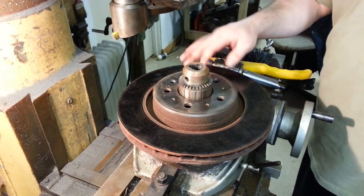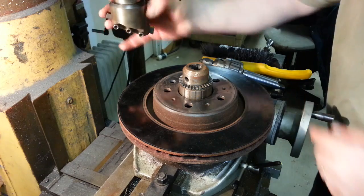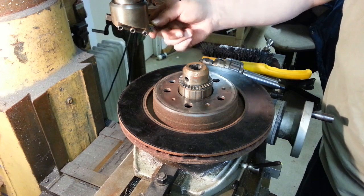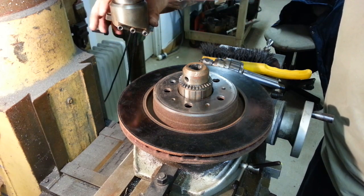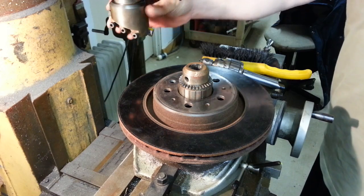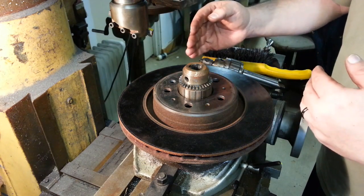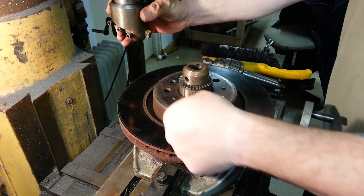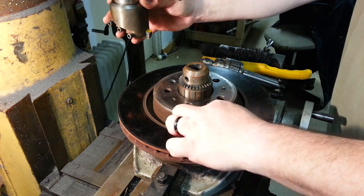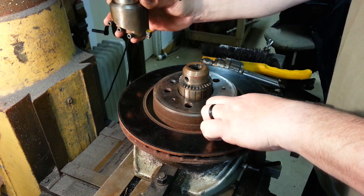For this next task I have to center this on the rotary table pretty accurately, because this cutter actually has a negative rake to it in relation to that surface. The angle of the fly cutter is a bit steeper than the back rake on this insert, so I have to get pretty darn centered up on this so that as I rotate it around it doesn't orbit off-center and contact the inner part of the disc. There's a relief right here so I'll have plenty of clearance to machine just the friction surface.